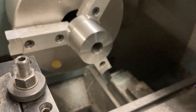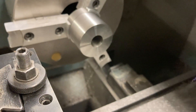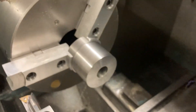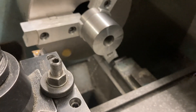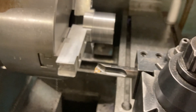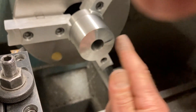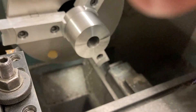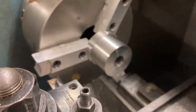When it comes to grooving, I want some support pushing that bad boy into the chuck so it doesn't peel out — probably wouldn't, but we don't want to take any chances. So we're going to use this boring bar and just bore it out to about an 860 diameter, and we're going to put a 60-degree angle on it to match the center. 625 RPM, spindle on, cool mist.